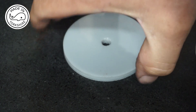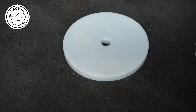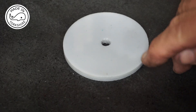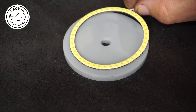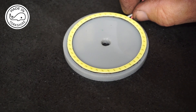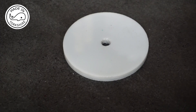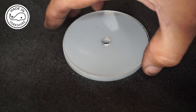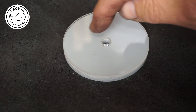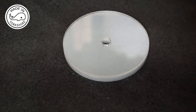Once it's set, I'm going to put that on the middle and create a groove around the inside — half the depth — for that ring to sit inside. Once I've done that I'll put this to one side, put this on top, bolt them together, and then mill out the big hole to go over the spindle.